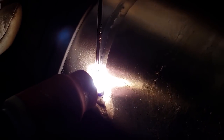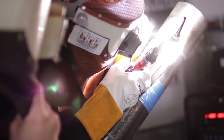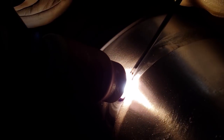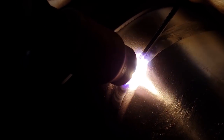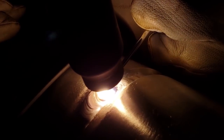I noticed that when trying different welding techniques on aluminum that may work on other particular metals, when it comes to trying to backfeed aluminum, it is almost as if the filler metal senses the electricity of the arc. With the filler metal backfed internally inside the pipe, it will actually arc out to the bevel tips themselves.